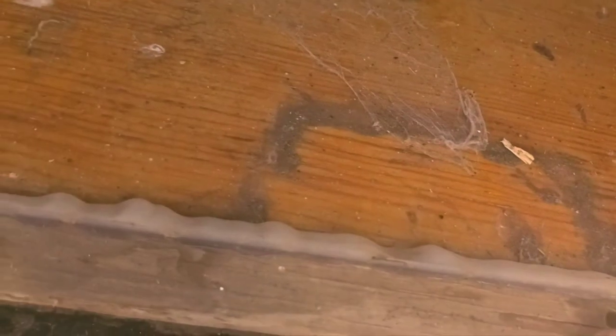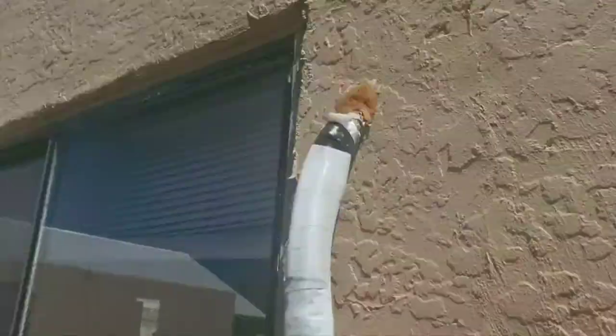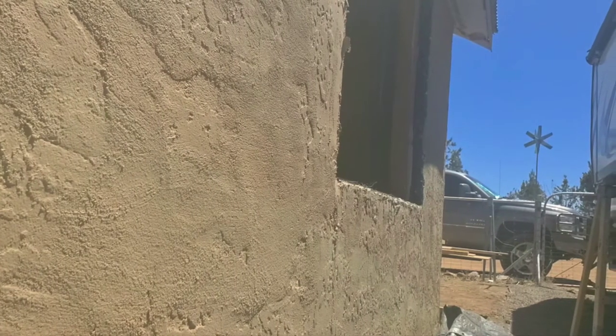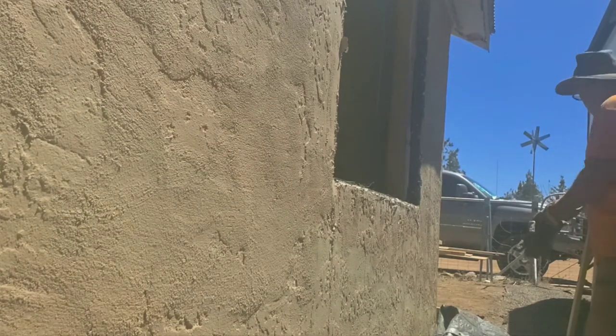There is a hole right there — they have six-inch spikes. That one was rusted off, and that one was rusted off, but you can see them. There's one, there's one — the last window had twelve spikes in it. It was the same size as the one I have to change on the other end — just a three by three window — and it still had twelve spikes. That's what we're up against. They didn't want them coming out, so it's better than shoddy work.